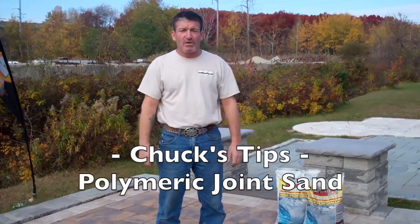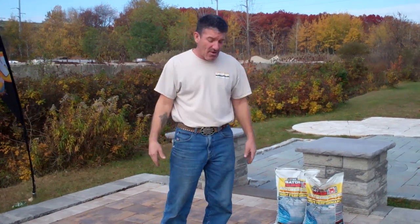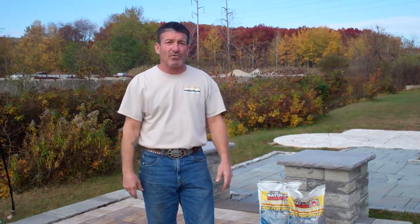I'm going to do a little video today on polymeric joint sand application. Just a quick how-to, the right way and wrong way. Some guys use stone dust. That's a no-no. You're spending money on a concrete paver or even a City Hall brick paver. You don't want to have maintenance on it, meaning pulling weeds, watching the anthills grow through your pavers. Polymeric joint sand is the way to go.